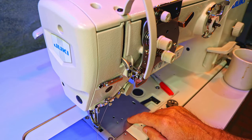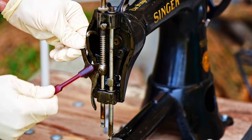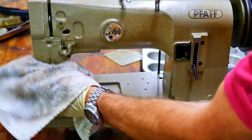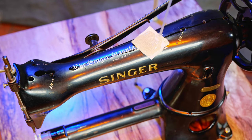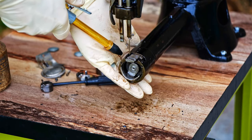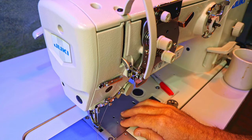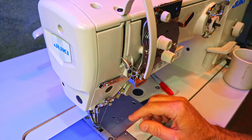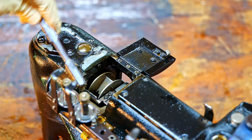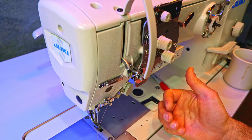If you've got a machine that's new to you or you haven't used it in a long time, clean and lubricate your machine. There's a lot of good information on the internet about what solvents to use. If nothing else, just use sewing machine oil — use lots of it, put it on, wipe it off. If you have an air compressor with good dry air, blow all the lint out. By giving it a thorough cleaning you get rid of lint, you might find a broken needle tip or thread wrapped around certain parts. Those oils can get gummy and attract dirt.